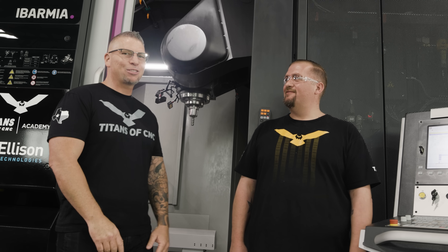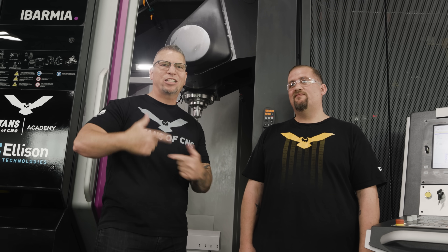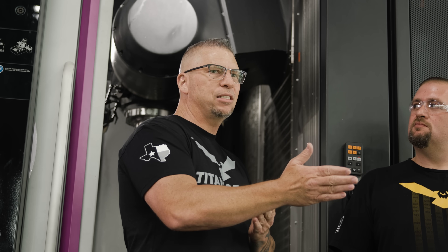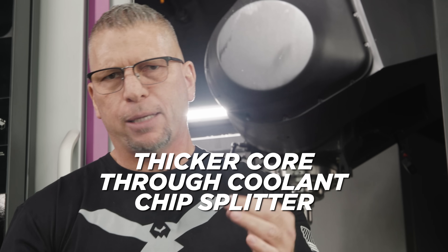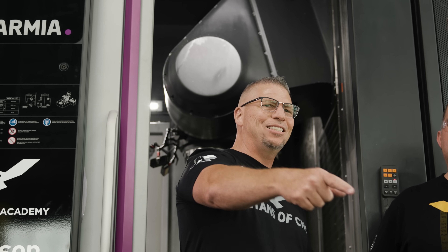Stick around to the end of this video and I'll show you how we calculate our torque and horsepower and what's safe for this machine. Being partnered with Kennametal and knowing all the top guys, I went to them and said we need something with a thicker core, coolant through, with chip splitters. I got to work with Danny Davis, Steve George, and the team — and we named it the Core Five: big core, five flutes.